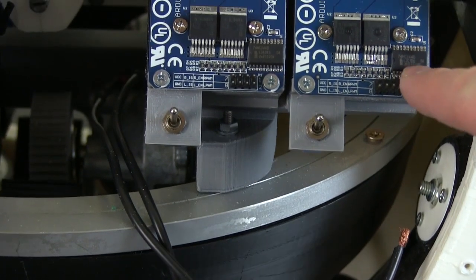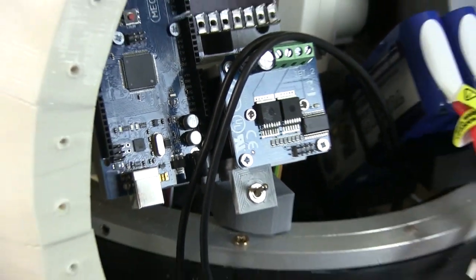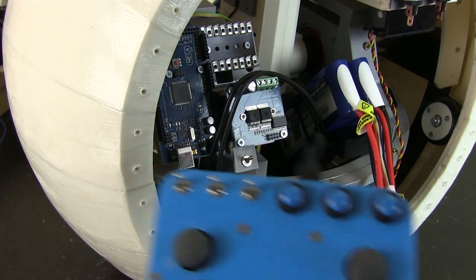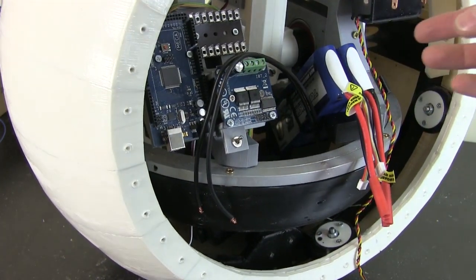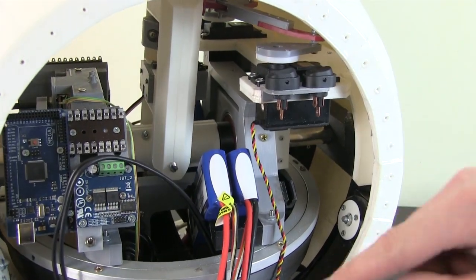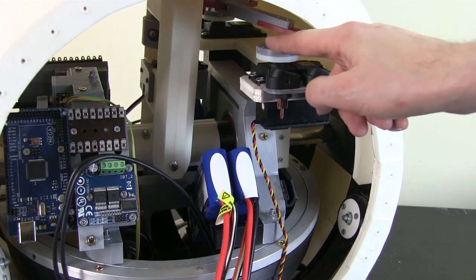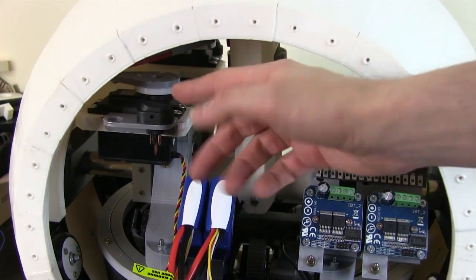That's a logic-level enable going into the enable pins. I can actually drive it from a logic-level enable out of the Arduino if I wish, so one of these could enable all the motor drivers and switch them off again — quite useful. But there will definitely be hardware switches so I can turn off individual motors for diagnosis. I've also got other switches fitted: one will switch the 12-volt batteries on, another cuts power to all the head control arm servos, and another on the other side is for the 24-volt on and off.